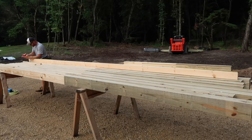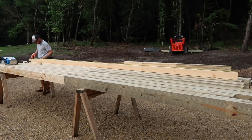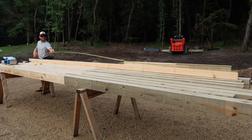For us, those marks are our heel height — the bottom of our truss is at 16 foot on every post — every post has a wall girt going at 39 inches for our wainscoat, and every 32 inches after that. We've got these marks that we just need to repetitively put on every post, all based off of that reference mark derived by taking the laser around the site and marking each bracket where grade was.